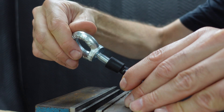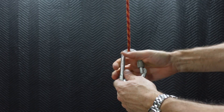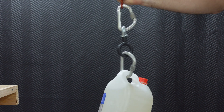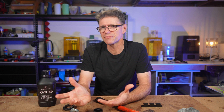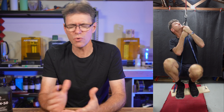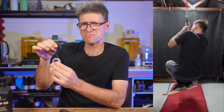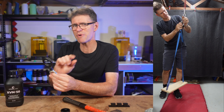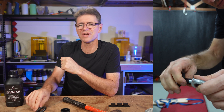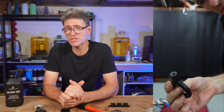To test it I set up a simple rig using a rope, an M10 eye bolt that I could thread into the iNut, and a carabiner. I first tried a five kilogram weight using a container filled with five litres of water — sure enough, no problem at all. But what about my own weight? I don't have lab equipment for a scientific test but I weigh about 85 kilograms, so I fully committed and tested if it could hold my weight. This isn't a dynamic load and I wasn't on it for very long, but the thread handled both the seated weight and the full 85 kilograms when I was fully suspended. There was no sign of damage or deformation to the ring after it held my weight — a very encouraging result.